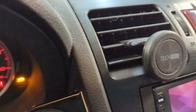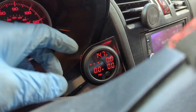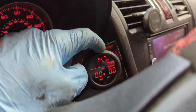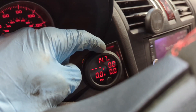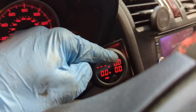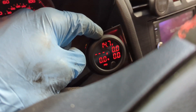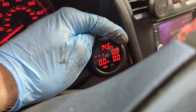One last thing I wanted to show off: for my setup I've installed a five-input oil pressure gauge. At the very top will be AccuSump air pressure — that's on the air side of the AccuSump, and right now it's reading 14.7. These three zero readings are three different spots in my oil system that I want to track. The first spot is right on the oil side of the AccuSump.